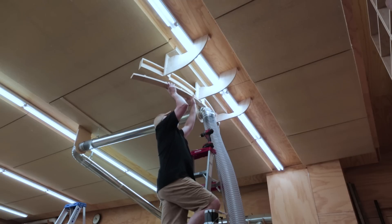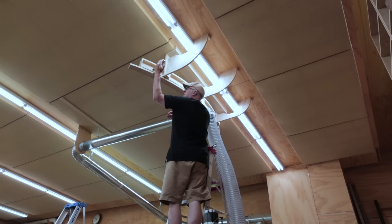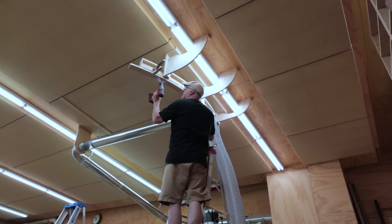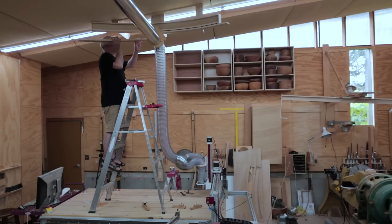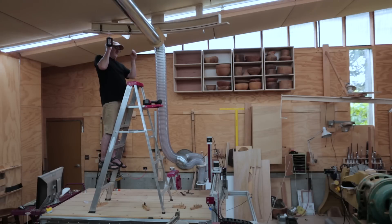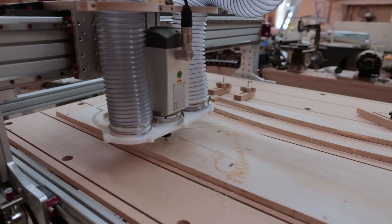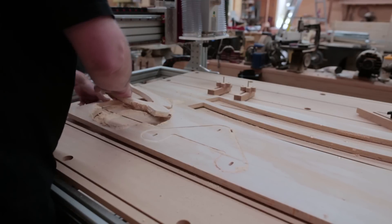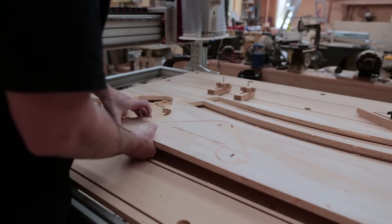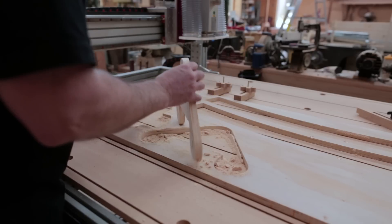Then I attached those tracks. By making the track separate I could also make them a little longer, which was needed because of the way I was thinking of doing the wheels and because there wasn't a lot of room between the pipe and the track. I made the track in two pieces, mostly to save wood — cutting one long curve on the CNC machine uses a lot of wood. I also recut the support that goes between the pipe and the vertical wheel, making a support for the horizontal wheels. My first piece that held the wheel and pipe was a little too short — I needed more space between the pipe and the beam.